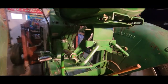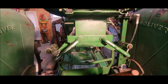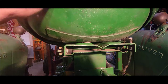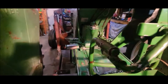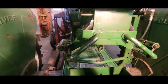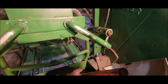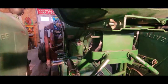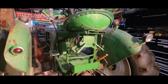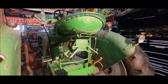Well, look at there — it's all back together, just like it came off the assembly line. I had to have my wife help me because, as you can see, you've got things that want to go this way and that way, and a lot of things to pinch your fingers with. Like you all know, I always grind the ends of these roll pins a little bit to help get them started. You can pound them in with a steel hammer, but I like to use bronze punches when doing stuff like that. Anyway, it's sitting high and proud just like it should. All I've got to do is put that pumpkin back on and it's ready to go. We'll see you next time we do something — we'll videotape it again. See you later. Happy Spring.